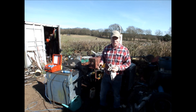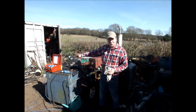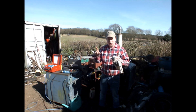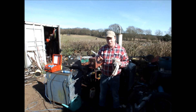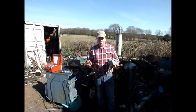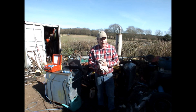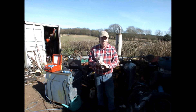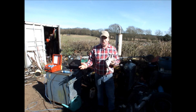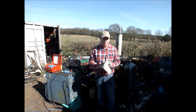What I'm going to do: I'll start it, and you'll see that when I bring the load on, I'll bring the camera into this panel just here, and you'll be able to see that I have to bring the engine speed up myself manually. That can't stay like that — being a generator, it's got to be automatically controlled. So in another video, we'll actually put a full electric governor on it. It's really not difficult and the kit's not that expensive, but this engine never had one. It's got an internal governor in the diesel pump, and it's just not up to the job of keeping the RPMs where they need to be.